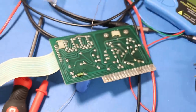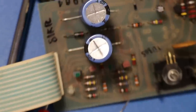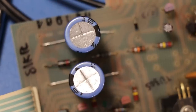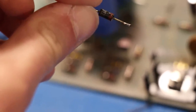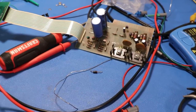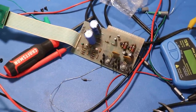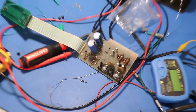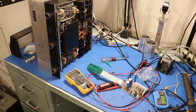Getting back to this capacitor being warm - when I felt it was warm I knew the issue was on this board. I checked these little diodes in between the caps, and one of them is not like the others. The red band one is original and the silver band one is new. That original diode has a cracked case - it's actually a shorted diode. I replaced it with a 1N4007 because McIntosh doesn't give you actual part numbers - they give you a McIntosh part number. You can kind of go off the size and what people say in forums. 1N4007 seemed just fine. Once I replaced that diode, the lamps worked.